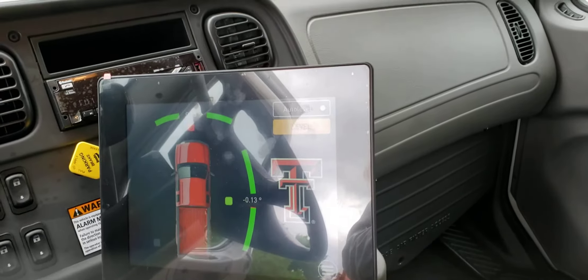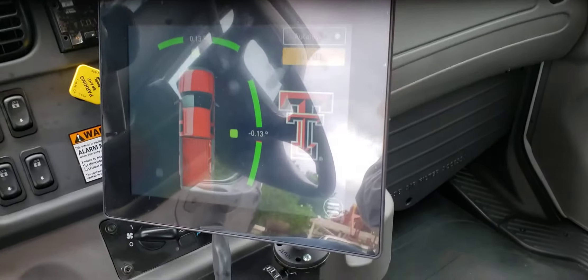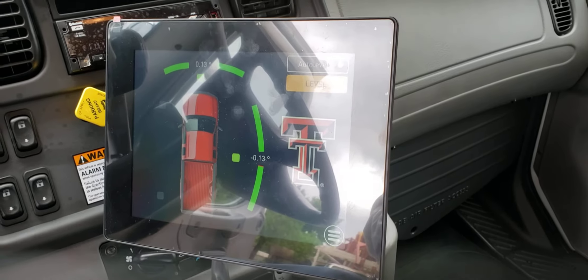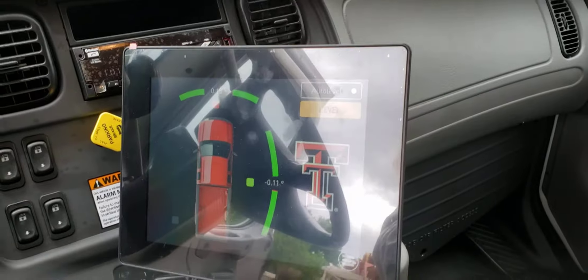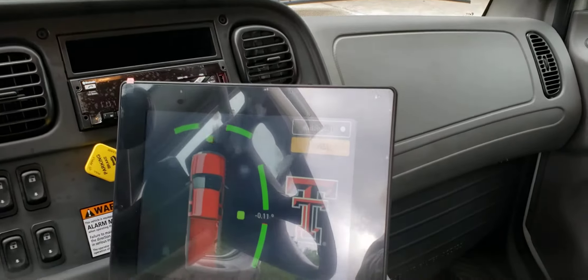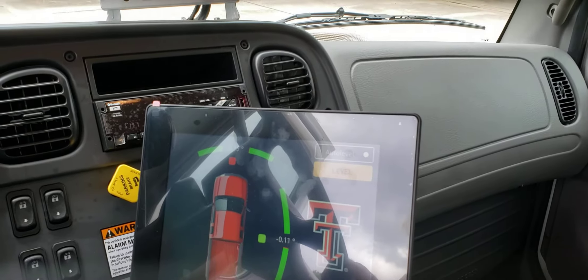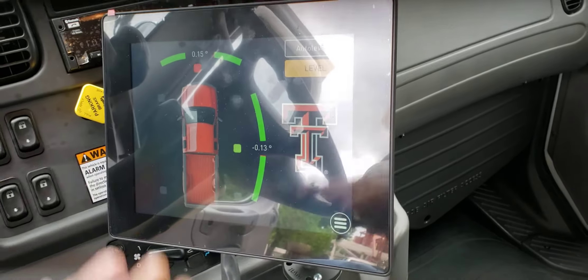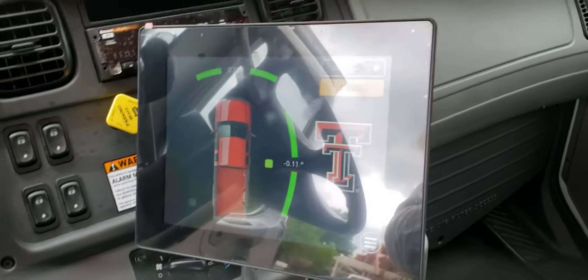The big reason for this is that if they set up on a dirt road or have to get partially off into a ditch or embankment, the radar has to stay absolutely level. If it does not stay level, it'll throw the beam off, which will change the trajectory. So if one of the outriggers sinks down into the mud or shifts a little bit, this system will automatically re-level.